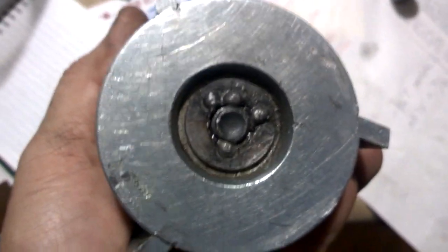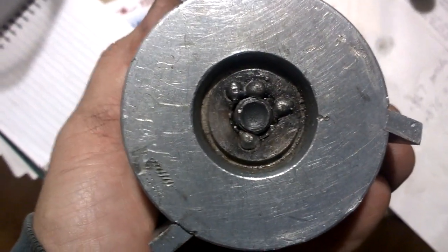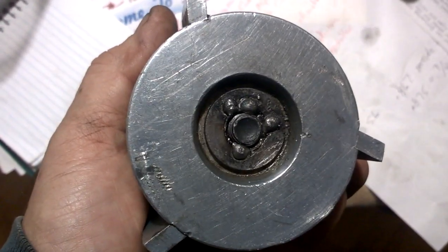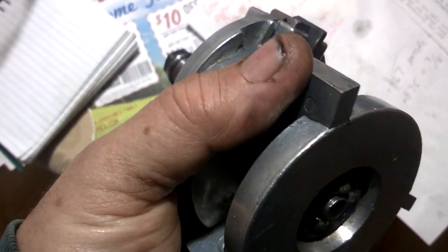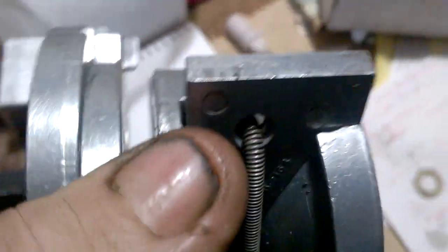What I did was what they should have done at the factory — weld a washer to the top of the insert so that when it pulls on it, it just pulls against the bottom and it can't come through. You can still remove it by hammering it through from the other side though. That was a lot of time to figure that out.